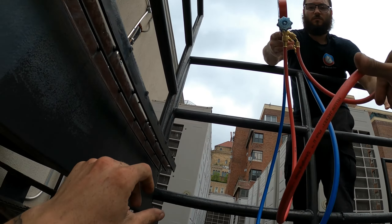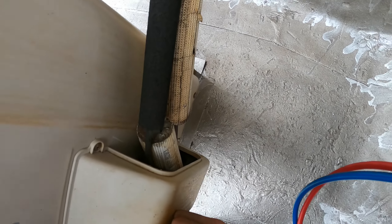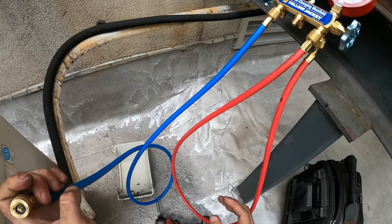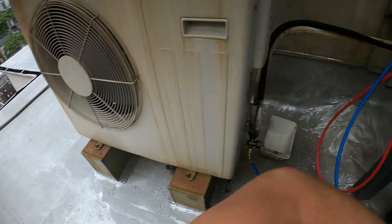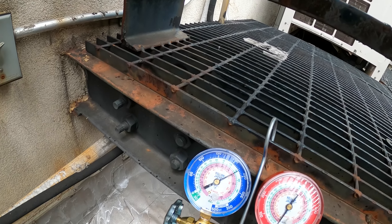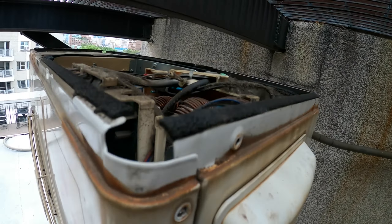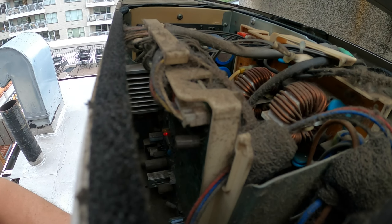Let's see what we got — let's open this one up and have a quick look. The pressure reads around 225. It might be refrigerant 410A. That thing's got to be shut down. Just opened up the top cover — here's the board. If you look inside there, there's a yellow and red light, a steady one.